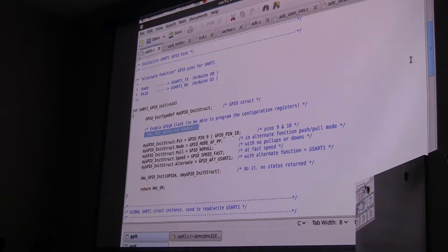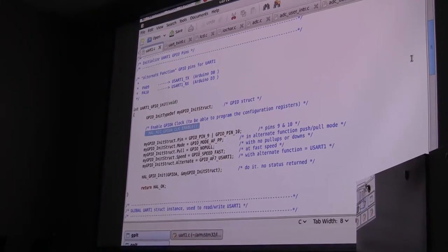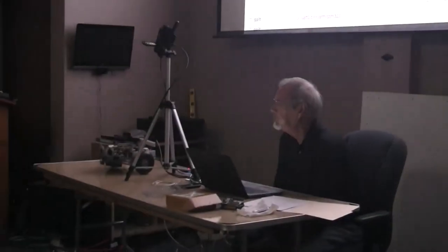struct. On those pins, are they like the Arduino, where some of them are PWM-compatible and some are not? All of the above. All the pins are general purpose, so any of them can be made a USART, any of the pins can be PWM, any of the pins can be a driver. Typically, each pin will have 4 functions or more that can be directed to that pin. So you may have to select specific pins where you have the PWM function that you want, then select the PWM function to go to that pin, and now you have PWM on the pin.